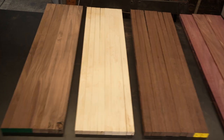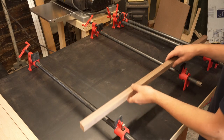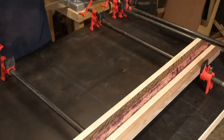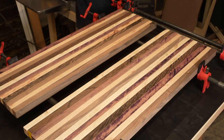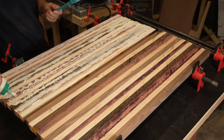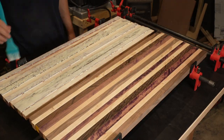This is what my pile of lumber looks like in one inch strips, and it's time for our first glue up. I turn every piece up on their edge for the first glue up, so these panels will end up being one inch thick. I'm using Titebond 3 glue because it's more water resistant. I don't let my panels exceed 12 inches because I only have a 13 inch planer. Each glue up uses four clamps, and I'm able to get two of these 12 inch panels per glue up.